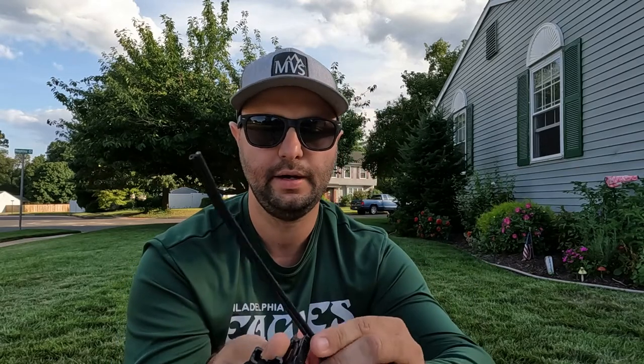What I really love about these spotlights are the ends. You don't have to actually strip the wire when you get to where you want to put your spotlight. All you have to do is take these clips right here — they make it so easy now. You actually take your wire and put it in between there, clamp it down, and if this was plugged in, the light would turn on. Once you clamp that down, the power will come on, the spotlight will come on, and then you can point it wherever you want in your yard.